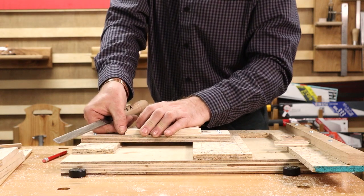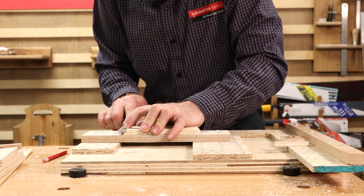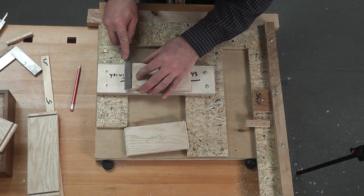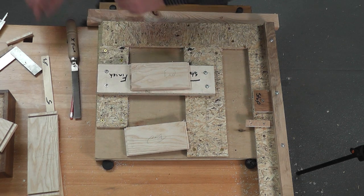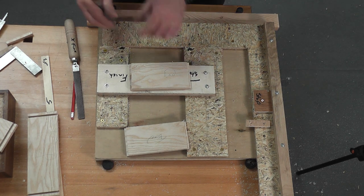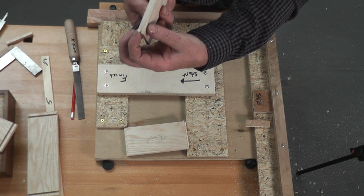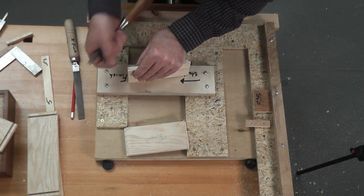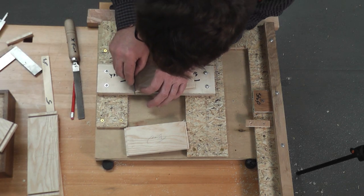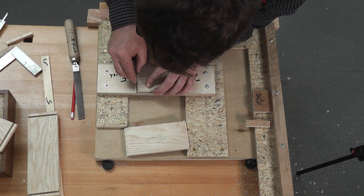So there's a tiny little bit on here, just over the edge of the cutter with the width of our board. I just want to take a tiny bit off. And there. Something I don't like on that back edge. Just got a little corner bit. Turn to action, just pull it. We could go chisel, or I think I'm going to go back to my marking knife. Let's check all four, the one there.